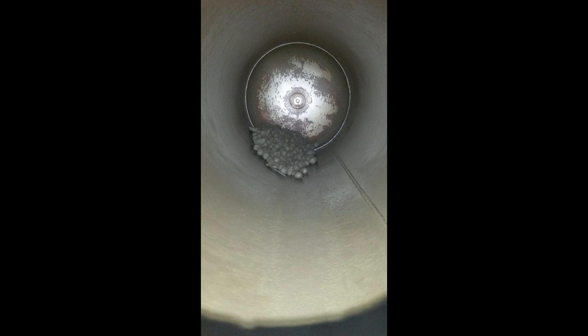The next set of images are of the tumbling process itself. This is inside the vessel before tumbling - you can see the surface rust. I wanted to inspect to see if there's any pitting to the tank. This is the media - you can see all the screws and balls, which worked very well. Here we can see the vessel tumbled for about six hours or close to a day. The media had settled to one end, so this needed to be sorted by leveling the tank. Here we can see the vessel nearly finished, apart from the two ends. At this stage all the media was removed and you can see how effective the tumbling process was. The entire inside of the vessel was then coated with a special wax oil liquid.